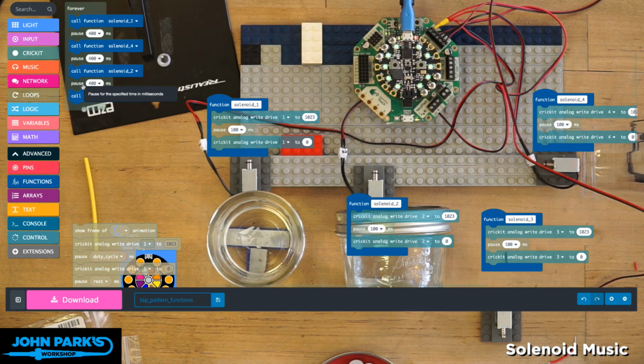And this is a nice thing I've noticed when you're doing the development: if you've got your Circuit Playground Express plugged into USB, you can just press the reset button and it goes into bootloader mode, which just effectively pauses it, and you're probably iterating over in MakeCode and getting ready to drop in new code.